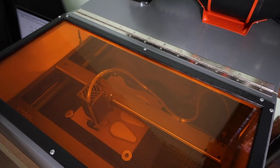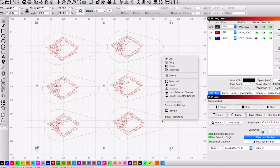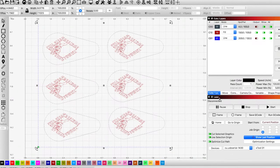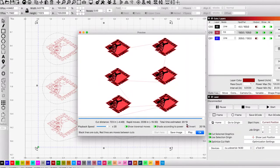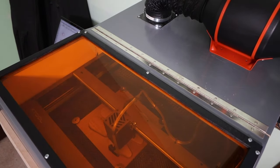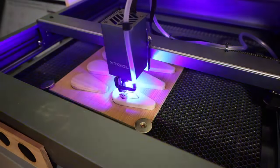Right away I can see there's a problem. I know I said we'd make an assessment at the end, but I really need to speed this up. If we look at the preview, you can see how much time the laser is wasting in the red area between the logos. To fix this, we can double click on the red operation and change the selection to fill shapes individually. These time estimates aren't always perfect, but it looks like we shaved off about 15 minutes for every six parts. For our whole run of 60 pieces, that's two and a half hours saved. Unfortunately my laser is kept in another part of the house and I don't feel comfortable leaving it, so I'll have to wait for them to finish — but at least I can get some design work done on some other projects.